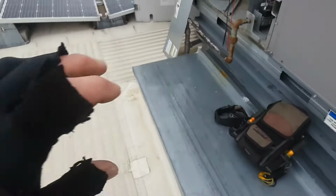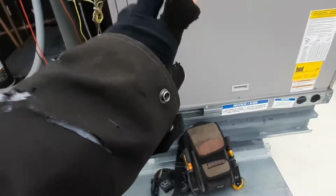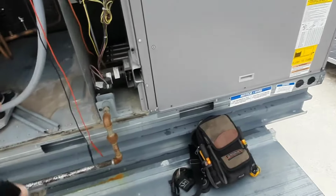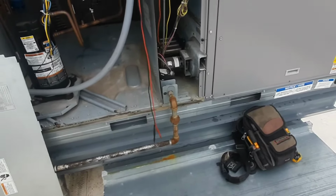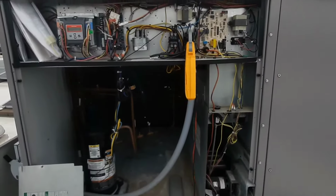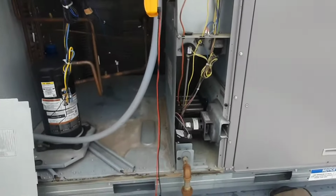We'll see what our return air is, and then hopefully just a slight gas pressure adjustment, maybe a slight blower adjustment. We can get this thing within range, because I'm on the top end of my range now, so everything looks like it's okay. Maybe it was just never started up and never adjusted properly.